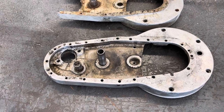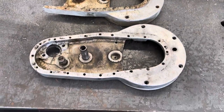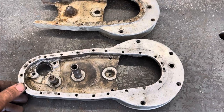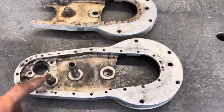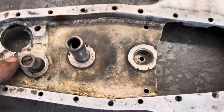Here are three Harley JD cam gear chest cases. This is the gear chest that has the drives off the camshaft that drives the oil pump and the generator or the magneto. This one is for a generator — that's why this extra stud is here, and this is the hole where the generator goes through. They break quite a bit in here.